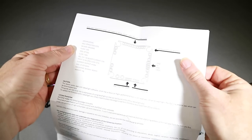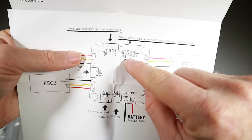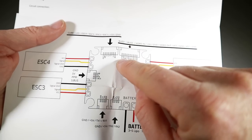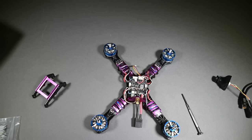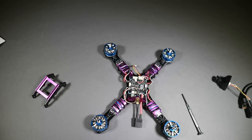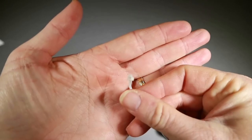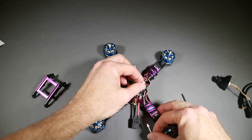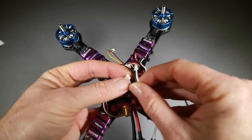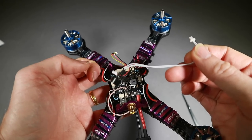The instructions are pretty good — a nice layout of the board. One floating lead turned out to be for the buzzer — there's a buzzer minus and buzzer plus. In one of the many bags of things we actually have a buzzer, there's not one on board. But this is a bit confusing because the buzzer and the connector on the board are exactly the same end — both the same connector — which is a bit of an oversight. I thought there should be a male and female, but I can solder that on. I think it's always worth having a buzzer.